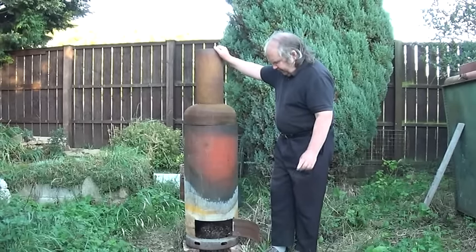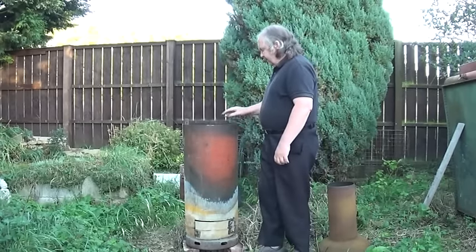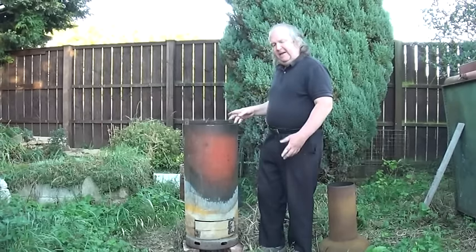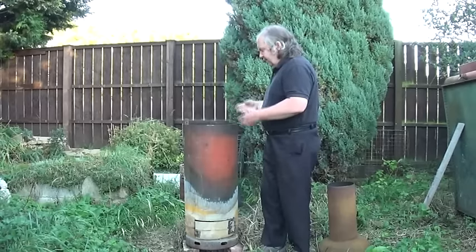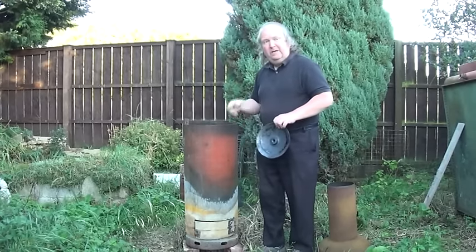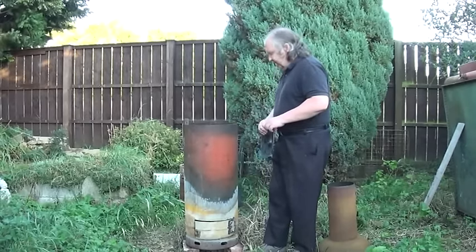The chimney bit is an old fire extinguisher with top and bottom cut off to make a cylinder. Just down inside the main barrel is the secondary barrel, which holds the wood you're going to turn into charcoal. That inner barrel doesn't catch fire — it just bakes using the heat from below. The flames lick up between the outer barrel and the inner barrel, cooking the wood inside into charcoal. The wood I tend to use is bits of old broken pallets, chopped up on a saw into bits about the size of your hand.